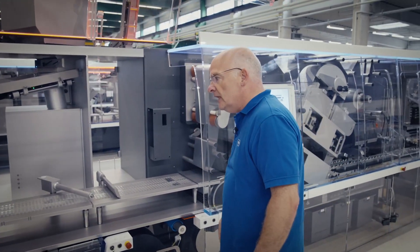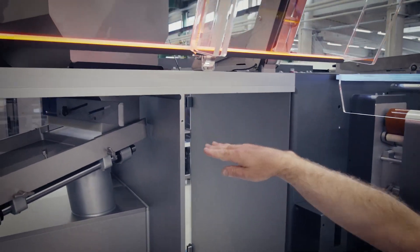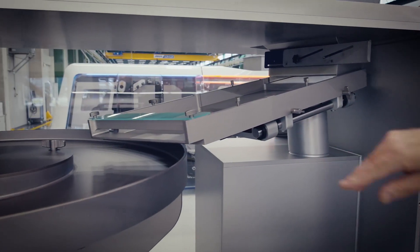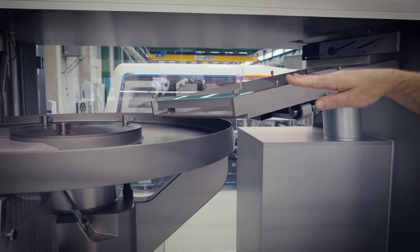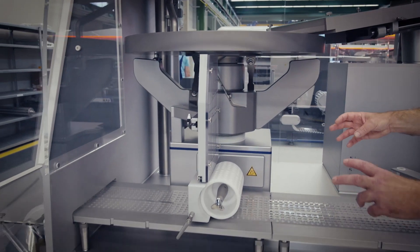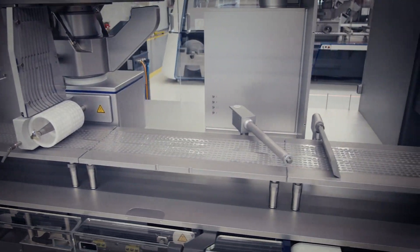Going back to the feeding elements: the product hopper takes a reservoir of tablets and spreads them over a seeding mechanism into the vibrating bowl feeder, where the tablets are guided via format into the web. The last element is the servo-driven drum which receives the tablets and presents them into this continuously traveling web.